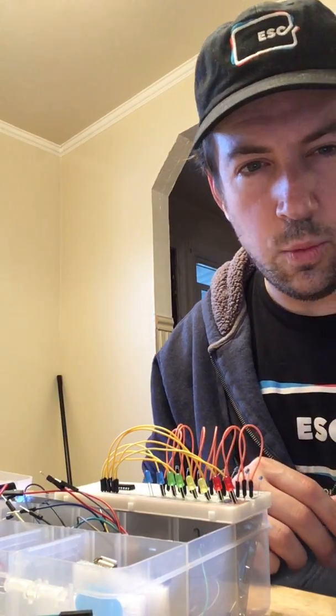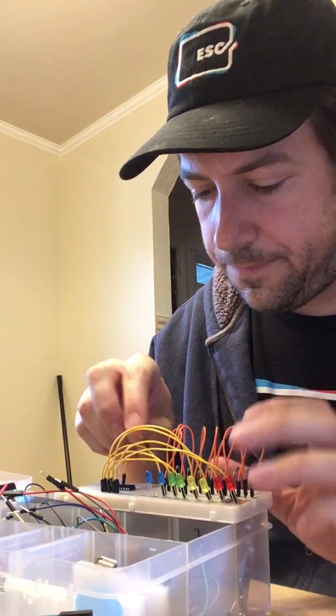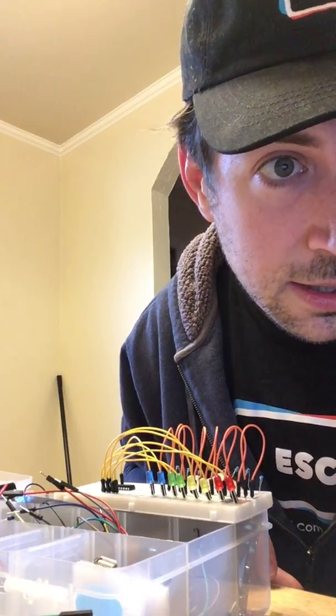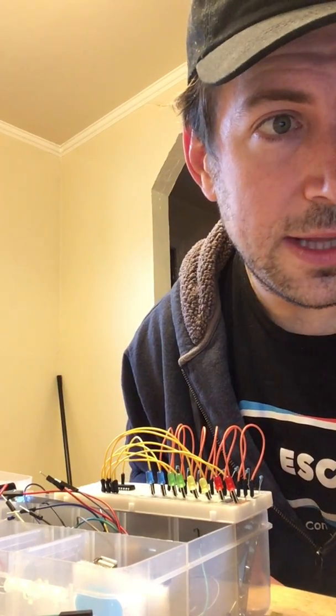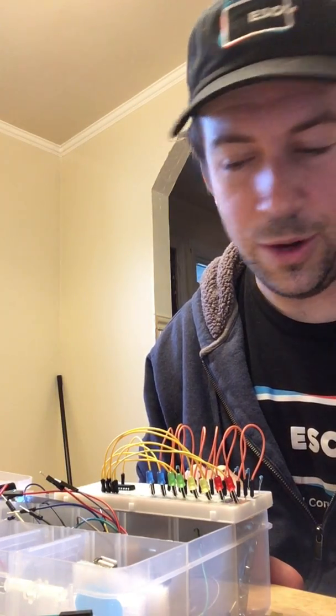Okay, so now all of my LEDs except one are hooked up, and the only one I have to do is going to be on the other side, the second one in on the other side. Now I believe that is correct. I have two different wire diagrams, so I can double check my wire diagram here and make sure these are LED, LED. Yeah, so it's Q1 through Q7, and then this one from the other side is called Q0. If I had bought this shift register separately, I would have been given a nice little diagram, which would show me all of the stuff I just explained to you. So it would just show me what goes where in essence.